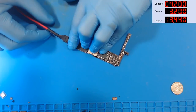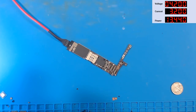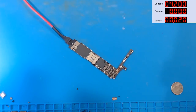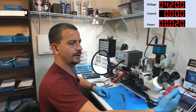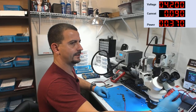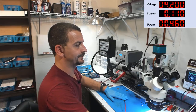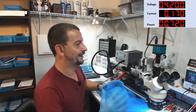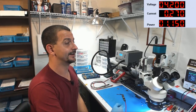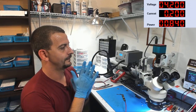And what we're going to do to decide if this is booting, I'm just going to watch the load, all right? So now we're going to turn this thing on. We're still drawing a nice 0 amps. And let's push the button to prompt it to boot. Okay, 1, 2, 3, boot. This looks good, 90 milliamps. Ooh, she's hanging at 90. Is it in DFU? Nope, 130, 150. I'm getting excited. You know, I don't watch sports, but I can get into this. This board's booting.